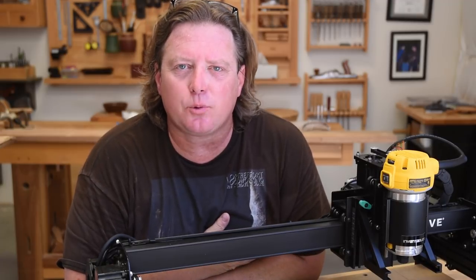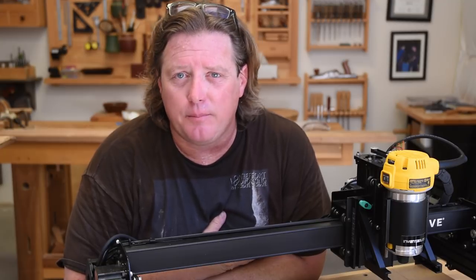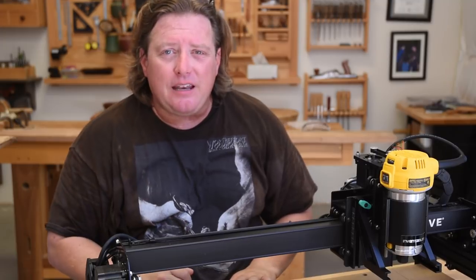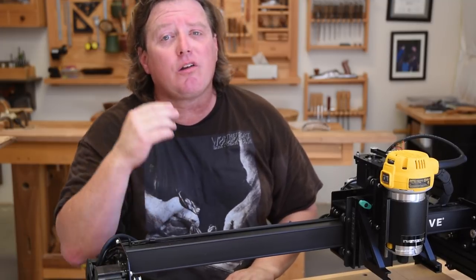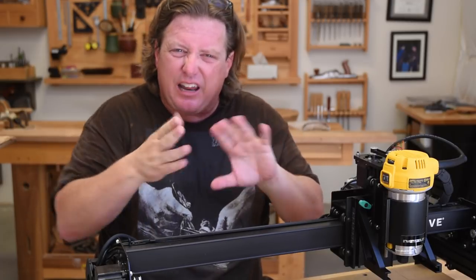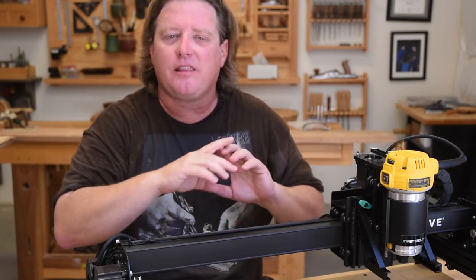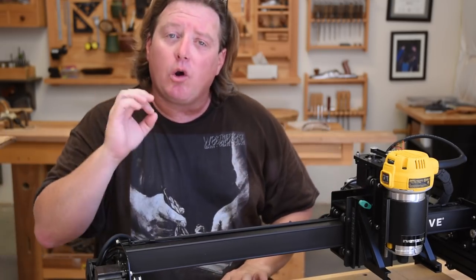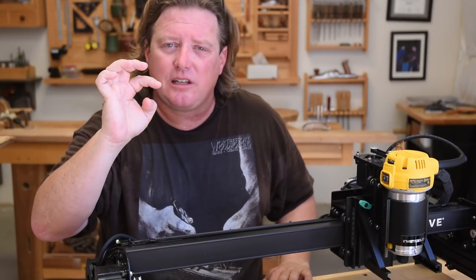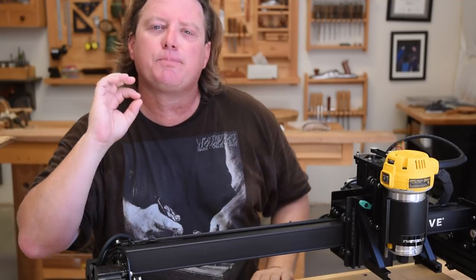Because there's going to be times where you say something like, don't strip the screws as you put them into the aluminum. Well, the kid's going to say, what does that mean? Well, you can explain, the screw's steel, it's a lot harder than aluminum, and it's very easy to cross-thread them, so that as it goes together, it gets really hard and goes in at an angle and doesn't hold as well, and you can't really repair it without drilling. So, in order to avoid all that headache, whenever you put the screw in, go backwards a little until you feel the threads click. That way, when you go forward, it will engage perfectly.